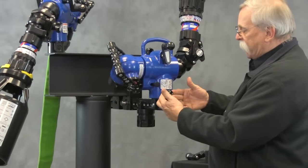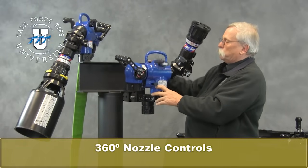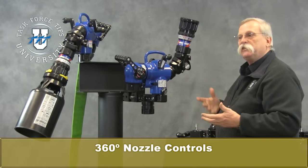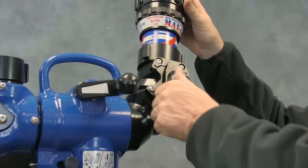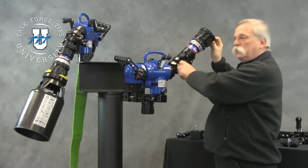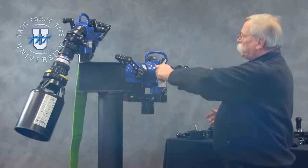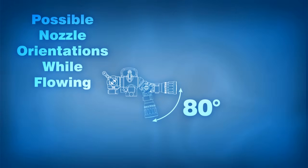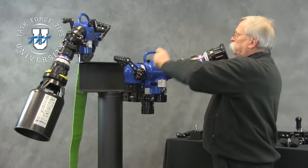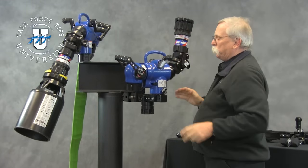So to summarize: the attachment lever, the rotation and safety lock, and the valve lock are the key controls. These operational controls turn the monitor up, down, left, and right, and can be operated at any 360-degree angle — they go completely around. The locking knob allows the elevation lock. Between those two movements, as you can see on the unit next to us, you can shoot up, straight ahead, or down — you literally have a huge field of fire. That gives you an overview of the control mechanisms and safety components integrated into it.